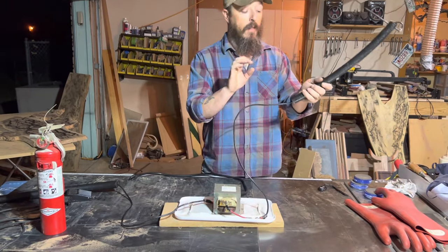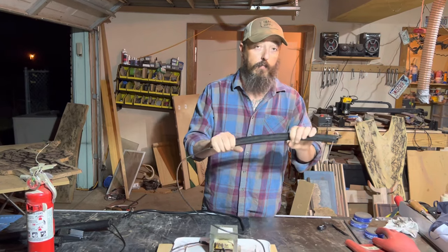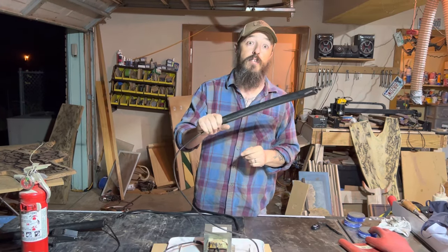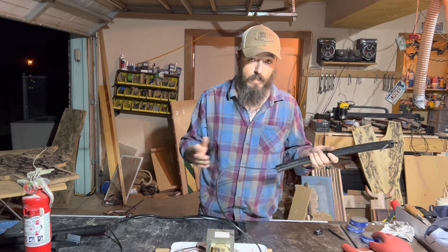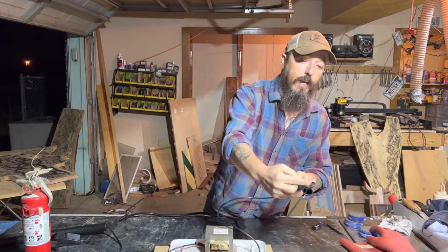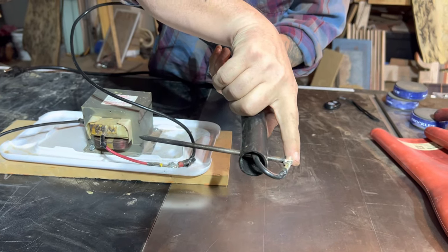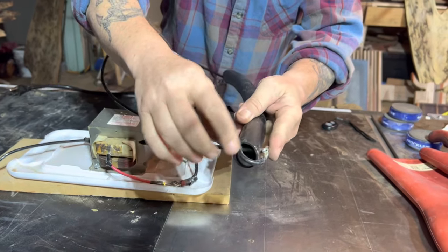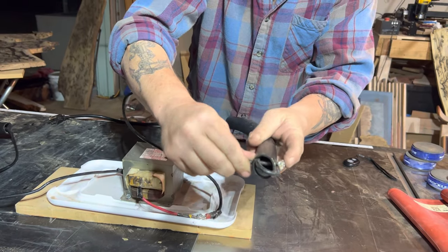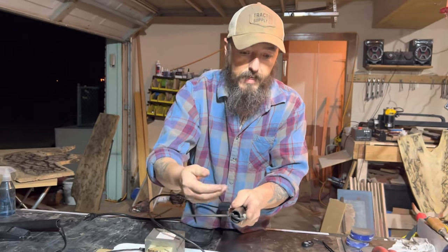The 8-gauge wire is roughly four to five feet long, and I have it run through this polypropylene pipe. Fun fact: polypropylene pipe only comes in 150-foot rolls, so I have 146 feet of this laying around my house — I might build more machines later on. I have a hole drilled through this poly pipe and a 60D nail going through it. I want to find a way to secure this better so I don't have such a big loop of wire there. I can foresee it being a cause of electricity jumping from place to place, and it's a factor I want to address to make it as safe as possible.